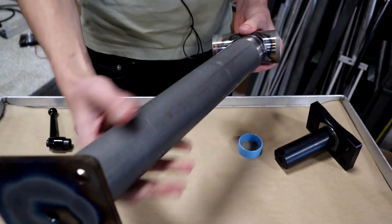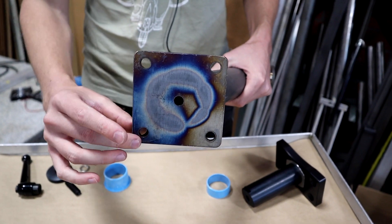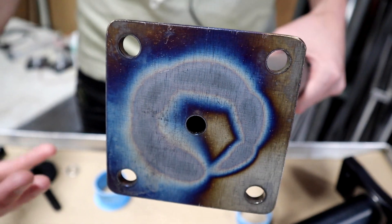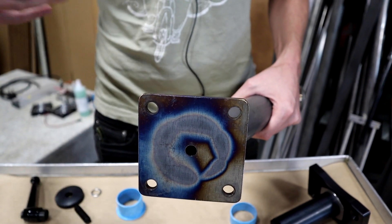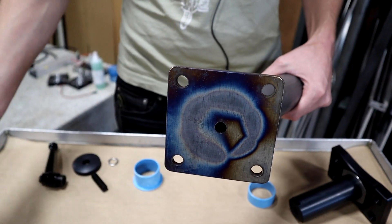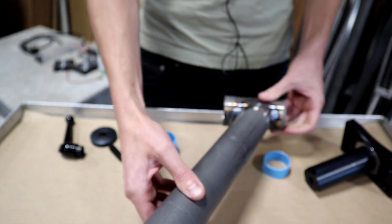On this piece here, we have a laser-cut plate made just down the street from me — a really cool facility to tour. The outside dimension is 4 inches by 4 inches by 1/4 inch. The bolt pattern here is actually diagonal slots. That way you can accommodate two different bolt patterns: thinking in inches, you could do 3/8-inch fasteners at 3 inches on center; thinking metric, you could do 10-millimeter fasteners at 75 millimeters on center. Both bolt patterns work just fine. Since I ship this product globally I've done everything metric, but if it's easier for you to work in inches, they're nearly the same bolt pattern so it fits both. Isn't that cool?